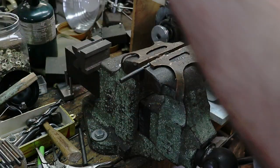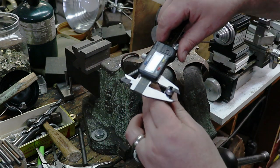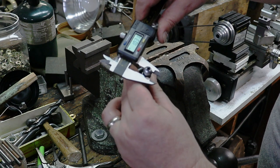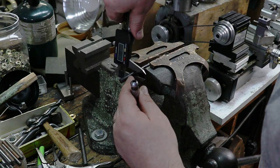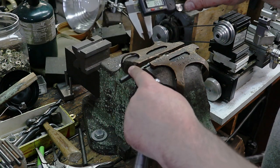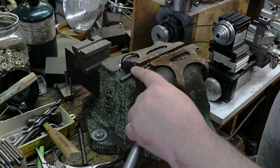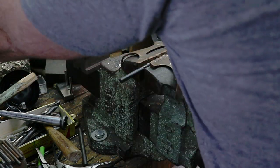And the reason why I chose that size is because it's slightly smaller than the spring size of the mandrel I need, which is about 9, 10 millimeters. So this being 9, 8 something, it's slightly smaller. So when I wrap this with the music wire, it's going to have some spring back when I take it off. So I want this to be just about a couple millimeters smaller than what I need. So we'll see if this works the first time. If not, we'll do it again.